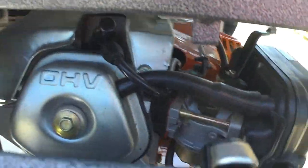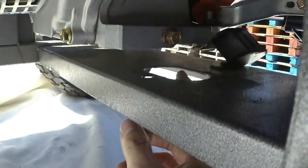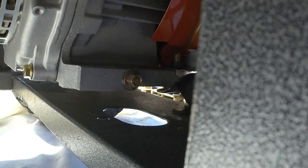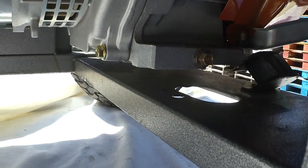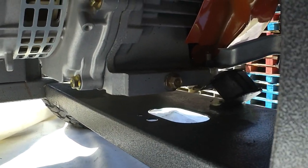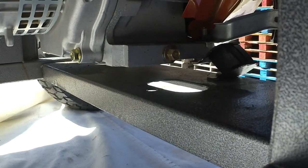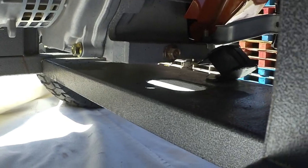Below here is where your oil drain is going to be — you see it right there. The oil drain bolt is located above that hole. Crack that nut open, take it off, put your oil drain pan below it, and it should drain right through that opening. When you're done, just tighten the bolt back down and you would fill it from the other side where I showed you earlier. There's no oil filter on this unit, so you'll just be able to drain, fill, and go.